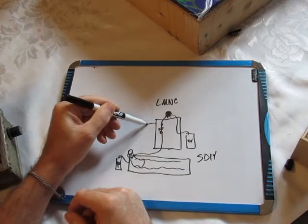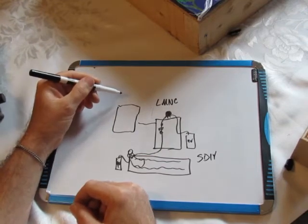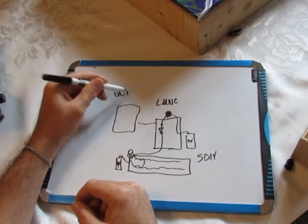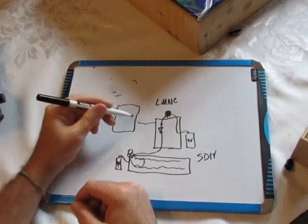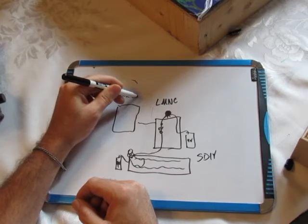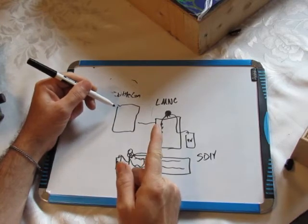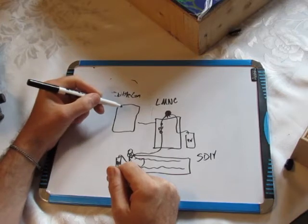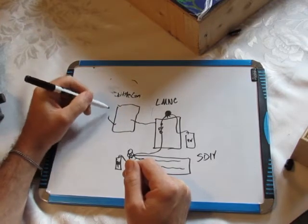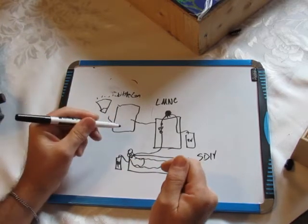So then, after it leaves this little oscillator, it goes to another strip board, which I found on runoffgroove.com. That's where it came from. It's called the Little Gem, and it's a very popular DIY device. Everybody who's interested in making sound does it. Most of them I saw were for guitars, but it works for this as well. So it's basically just the simplest form of an amplifier, and it sends its signal out to a speaker. So that is what's inside that box.